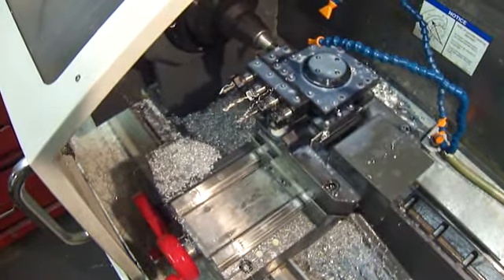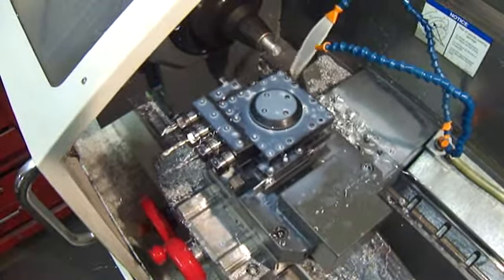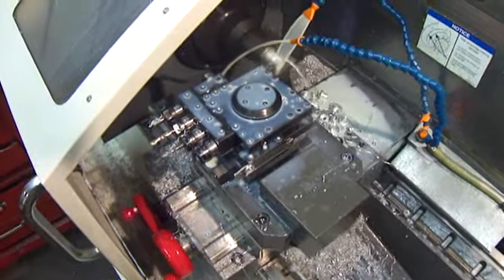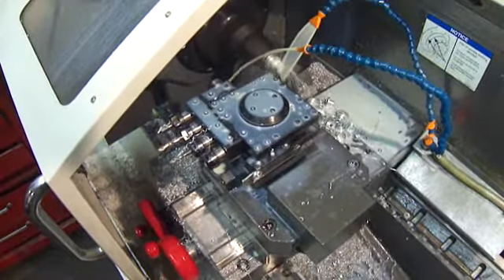The gang tool consists of a two piece tooling block and includes four special short shank ER20 collet chucks. We can also supply collets if needed. The tool holder is surface ground and comes with a nitro carburized black finish.